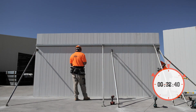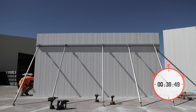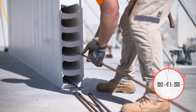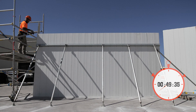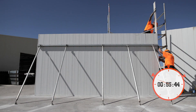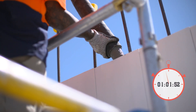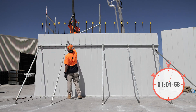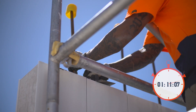Next, the whaler is screwed into the wall, then the final bracing is screwed onto the whaler. After this, install the horizontal reinforcement bars, then install the 9mm compressed fiber cement sheet as end caps. Install the vertical reinforcement bars, then core fill the wall with concrete using the boom pump off the truck. Finally, trowel off the top for a smooth finish.